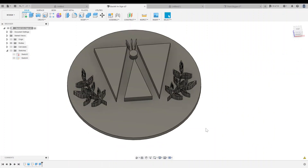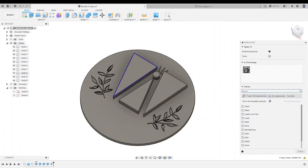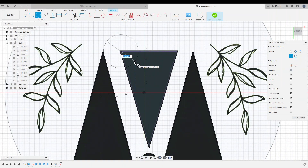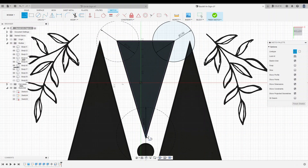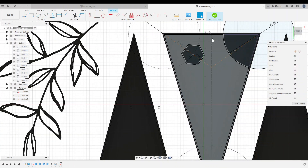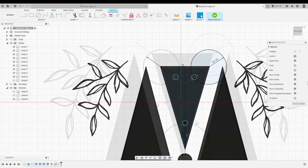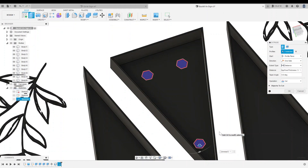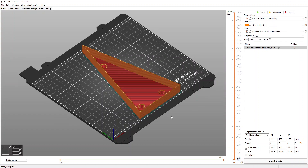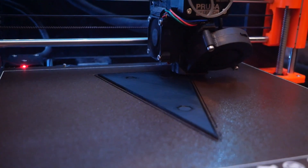The three triangles in the circle actually spell Viv, which I didn't realize for an embarrassingly long amount of time. Those are 3D printed shells which I filled with lights. By offsetting them from the face of the sign, you get this really beautiful backlight effect. The two branches in the lines above the eye are too thin to print as shells, but I still wanted to 3D print these elements to make all the black elements of Sarah's logo look cohesive. I printed these pieces out of black PETG and 3 perimeters were enough to make them completely opaque.